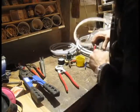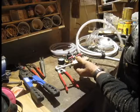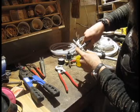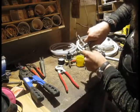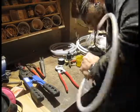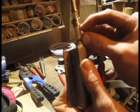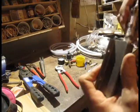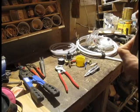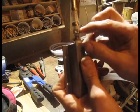Whenever you're working with these barbed fittings, you want to jam them on as good as you can, as far down as possible. Sometimes gently squeezing with a pair of pliers so you can give it a little twist is helpful while applying pressure to the other end. So the coupler comes up to here, and we want to make sure that we hit our pipe clamp right in the middle of that — for a good seal. Coupler to there, pipe clamp right in the middle of the hose.